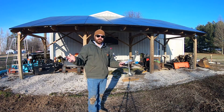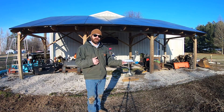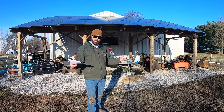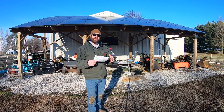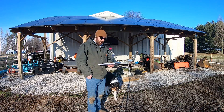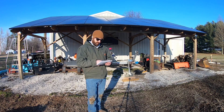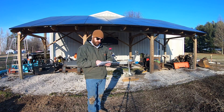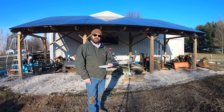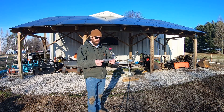PV Watts has a disclaimer — I think they recommend using 75% for calculations, and I think that's what I used when I calculated my system and recommend in my design video. But right now I'm sitting at 86%, so that means I'm ahead of the curve. I'm paying off this system faster than what I thought I would. My power is about 12 cents a kilowatt hour, so 25,424 times $0.12 — that's $3,051 that I have saved by installing this system in 28 months.